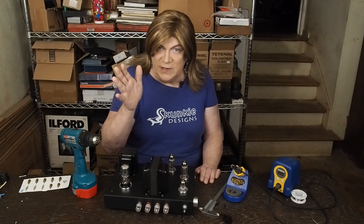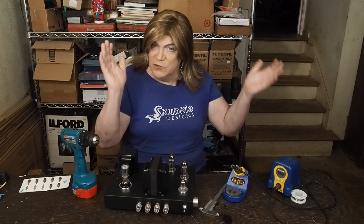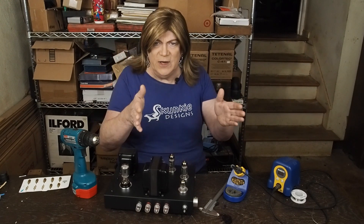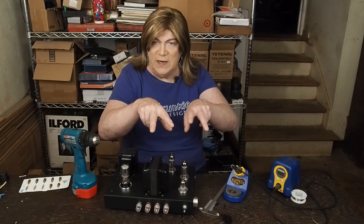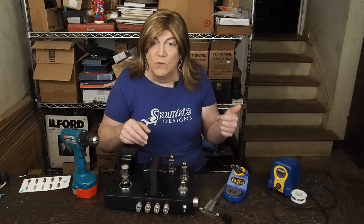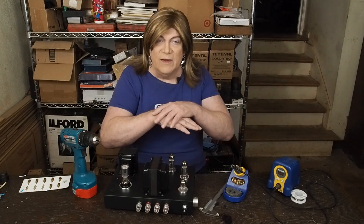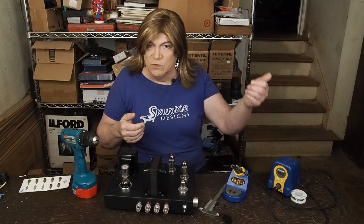What was going on in his house was the neutral was floating. In the U.S., there's 220 or 240 volts — usually it's 240 — coming into your house, with a center neutral, and it splits between the circuits to get 120 volts. Half the outlets are on one side and half on the other. When it was doing this wonky stuff, one of the circuits would go down to like 95 volts and the other side was going up to almost 150 volts. Full time, with the load on the circuits, one side was running at 135 volts and the other at 110 volts.